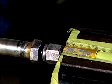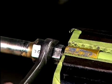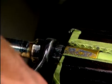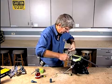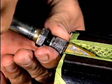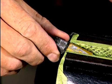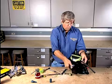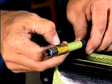I'm going to go until I bottom out, and then I'm going to back it up a quarter turn. The reason I back it up a quarter turn is so that when I'm done, that b-nut is going to be able to spin — just a little bit of clearance in there, but it's going to be able to spin. And we can see that we didn't have any slippage on our hose.